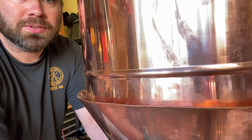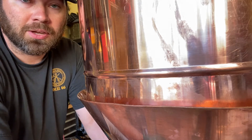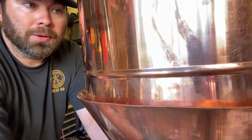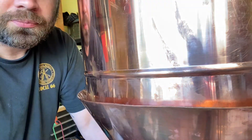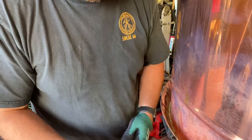The reason for the weight on top is to force this body tight inside the collar. If you got a friend that can help you build this at this point, that would also be beneficial. If you level it out and put a bunch of weight on the top, you're going to end up with a better product — everything will be squared up and level. Let's get started; basically what we're going to do is just solder the inside lip here and then move on.